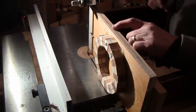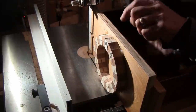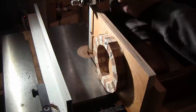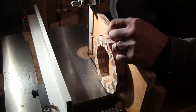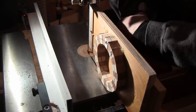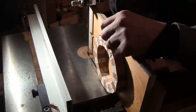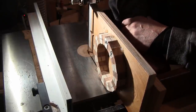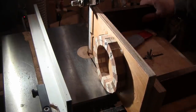I have this ring hot glued onto my band saw cutting fixture. It slides in this direction so I can make my cut, and in and out the other way so I can adjust how wide it needs to be. I glued each ring up twice as thick as I wanted so I could cut it and get two rings out of one. It's much easier to glue a thicker segment together than a thin one like 3/8 inch, and I think it's faster. This is more than 3/4 inch, which leaves me enough to trim down so they're 3/8 each, though my drawing shows it as a 3/4 inch thick row.